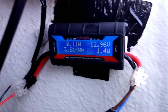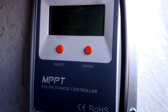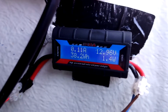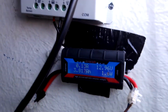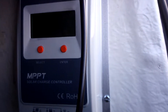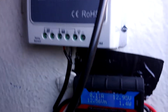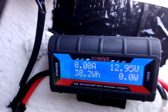Solar panels are quite good for me. The MPPT controller will be a godsend because what it does is regulate the charge coming through to my battery — pulling it down to the voltage required, around 13 volts. With a combined wattage of 70 watts, it will convert those over-volts above 13 volts into amps and feed the battery with more amp supply. At the moment there's not a lot of sun, so I'm not actually getting 13 volts at the best when I'm working, so I've bypassed it. All it's doing now is letting me keep check of what amps I've got coming in.